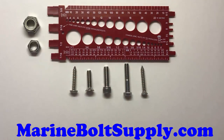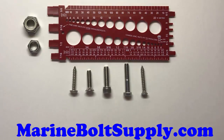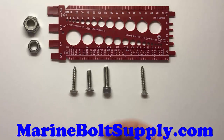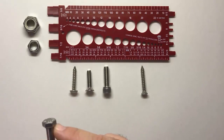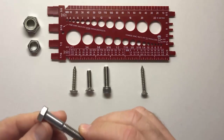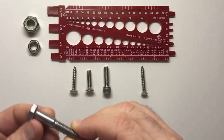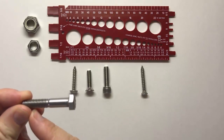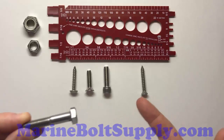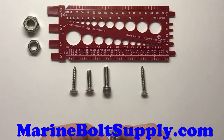Basically, a good rule of thumb is that if you have a bolt with a head — like this hex head bolt here — you don't include the head in the length. When you're ordering bolts online, they're not going to include the head in the length if it's got a head like this. So you always measure from underneath the head to the end of the bolt, and that will give you the correct length.